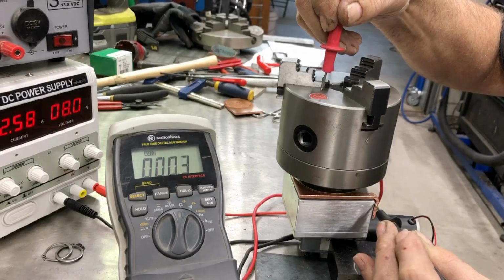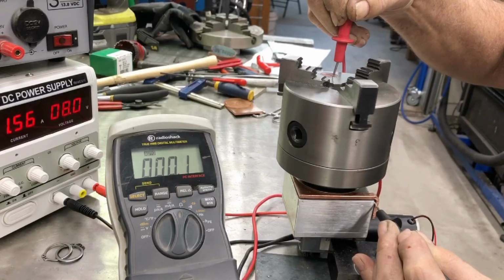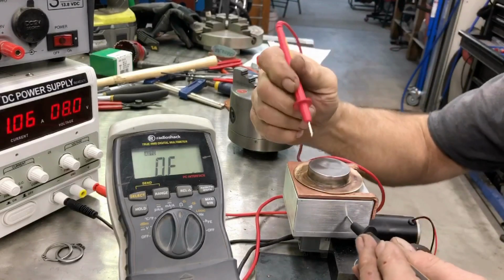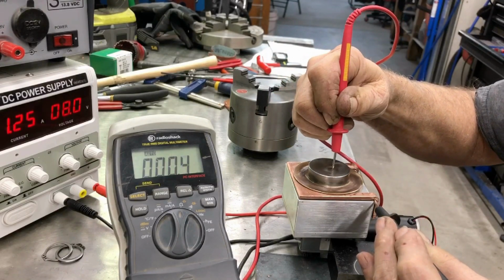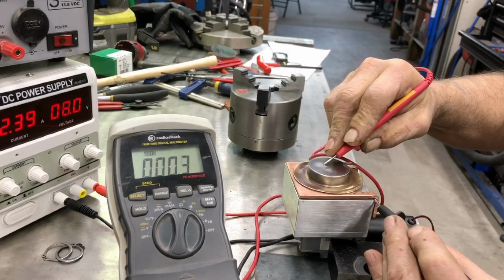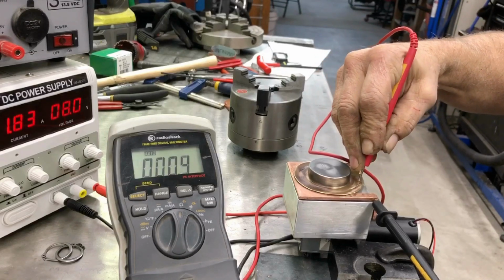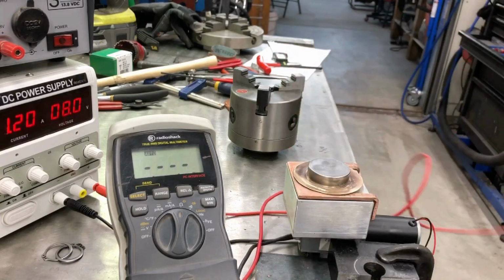Anyway, I managed to figure out that this thing is running a reliable 1 or 2 ohms resistance. That's close enough to zero resistance for me to weld without worrying about everything. So nice. You'll see here, I'm about to check it to try and get down to zero. And of course, it's handheld contacts, moving things, so it's constantly changing its resistance. See, there it's two. And I'm like, come on. Oh, one. Give me zero. So I tried it right on the copper. Yeah, there it is. Cool. So I have a reliable 1 or 2 ohm resistance. That's what I'm looking for.